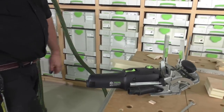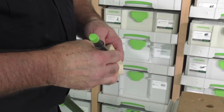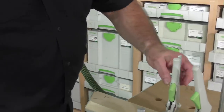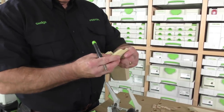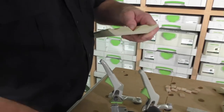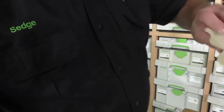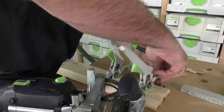Double checking. So what I'm going to do is one more label — I'm going to do tight on this side and loose on this side. Let me just verify that I got the right one in here when I set it up. See how you can get turned around really quick? When I take this and bring it in, this is exactly what I want. Everything lines up. So I'm going to do tight on here and label it one more time, loose. Let's do the loose first. That way, when the glue is setting up, you have a few minutes to position it so everything long point to long point meets up.